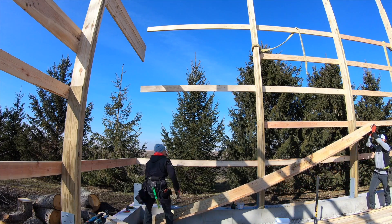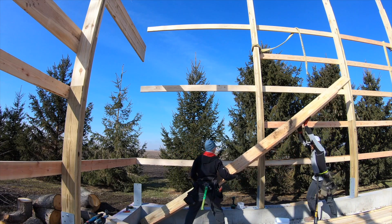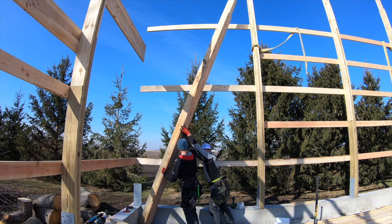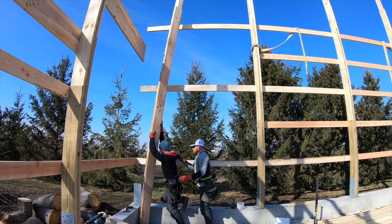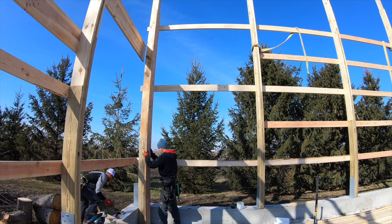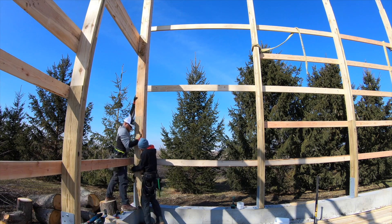Leave yours down, we'll use the wall — we'll stand it up and then just lift it up. Okay, you got it, you're gonna hold it. Nice, we got that corner locked in. Now we're gonna come over to this other corner and stand that column up. Greg's just wrapping up doing purlins and getting those trusses marked, so once we get this corner stood up and installed we should be able to try this truss. We'll probably get this all prepped and ready and then come back after lunch and start standing stuff.